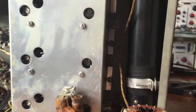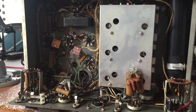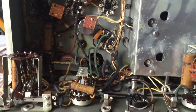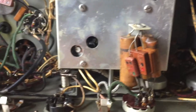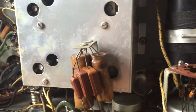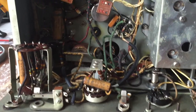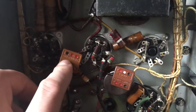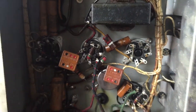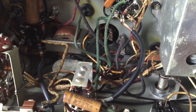That was a common trick I've seen — to use the batteries as a voltage reference. Anyway, the rest of this is in fairly clean shape. We've got some of these old paper and wax caps that are just shite. There's not even a point in testing them, these should just get replaced. There's presumably a bunch of RF happenings underneath this can here, underneath this shield. There are some more paper caps that are just probably gonna be crap. These early mica caps usually just never fail, so I don't bother checking them unless there's a problem.